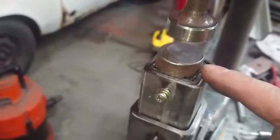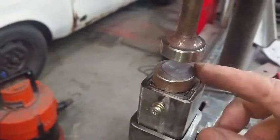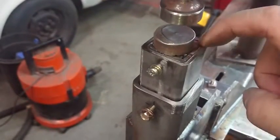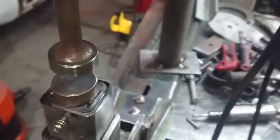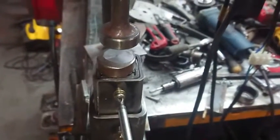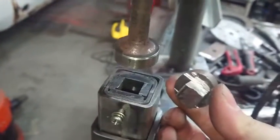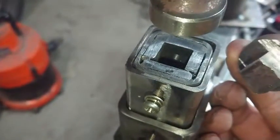That's just a friction fit — tap it with a hammer and it will fall out. The hammer head is from a normal hand planishing hammer. Steel was sandwiched inside there so that it's now a square die holder. The steel is layered up, about 15mm square inside there.